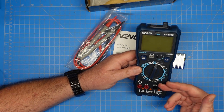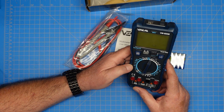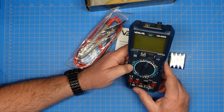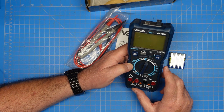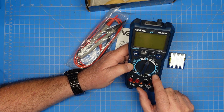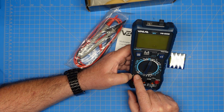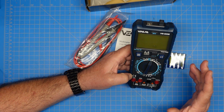That's built into the meter. This is an upgrade from the VM600A that we've had on this channel before. Right off the bat, we can look at the meter and test resistance up to 60 megohms, which is awesome. We can do continuity, go up to 1000 volts DC and 750 volts AC. We can also test current up to 20 amps with two different ranges — a milliamp range and an amp range. And then we have 100 microfarads of capacitance testing, plus duty cycle and frequency testing.